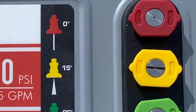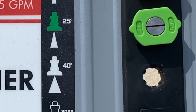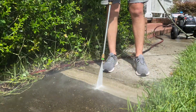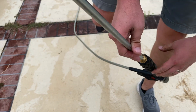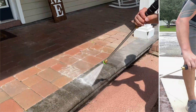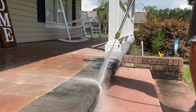The trick with choosing the right pressure nozzle is to find the widest nozzle you can use that still cleans your surface effectively — that way you make the most efficient use of your pressure washer and your time. If you're working on a surface you've never cleaned before, try a 40 degree nozzle in a less conspicuous spot. Hold the nozzle about two feet away and push in closer until you see it starting to clean. If you don't see results by the time the nozzle is a few inches away, try the next size down and repeat until you're making headway without risking damage.